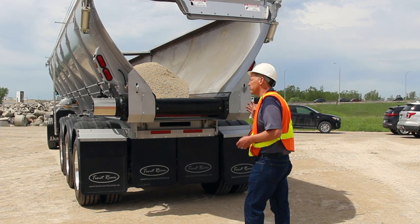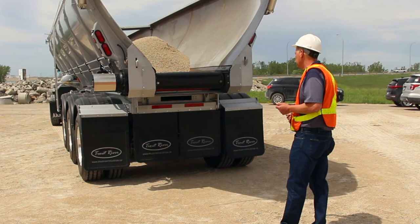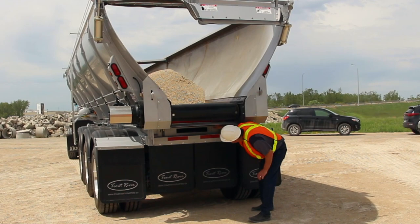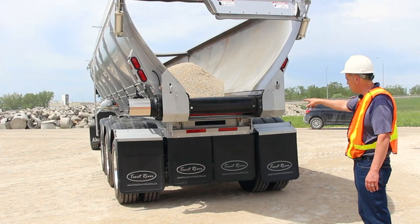You don't have to change it out for asphalt to gravel. It's temperature rated to minus 20 but can be operated down to minus 40 — anything beyond that, we shut her down. This red bar right here is spring-loaded; that's the sweeper that cleans the belt off as it's coming back. Anything sticking to the belt will get cleaned off and dropped right there.